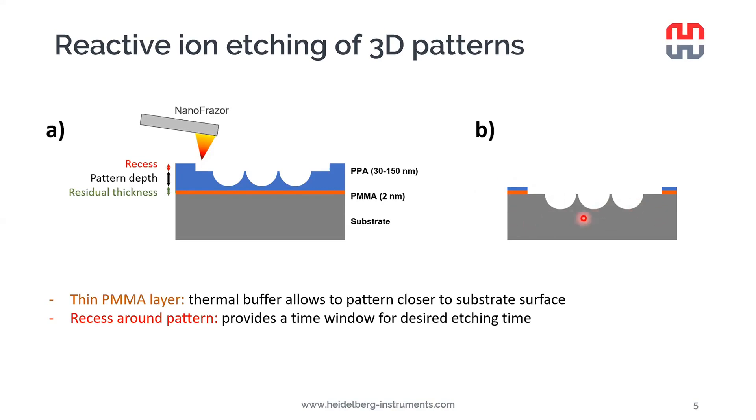For example, if we use a fluorine-containing gas — fluorine is notorious for very difficult-to-remove residuals on samples — if we still have part of the sample covered with polymer after etching, we are on a good way to get rid of most of this contamination later.